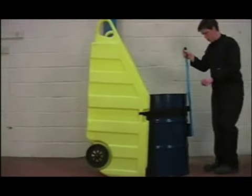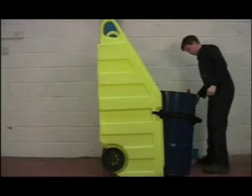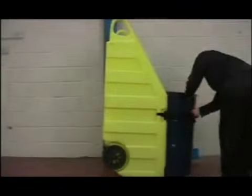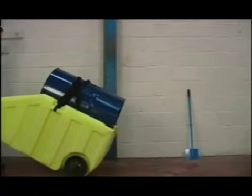Using a drum tilt, the drum can be easily lifted onto the platform by one person, following which the strap should be hand tightened. With your hand on top of the handles, place your foot onto the kick plate to allow your weight to balance the load to tilt back into moving position.